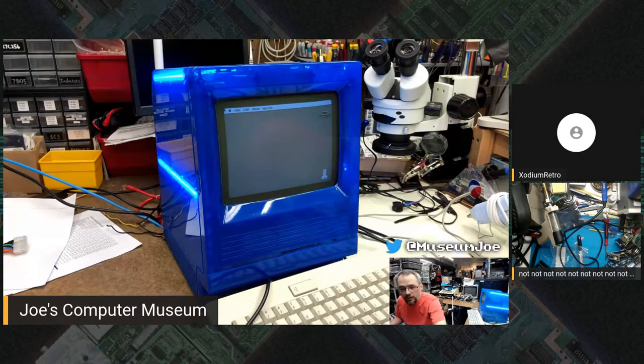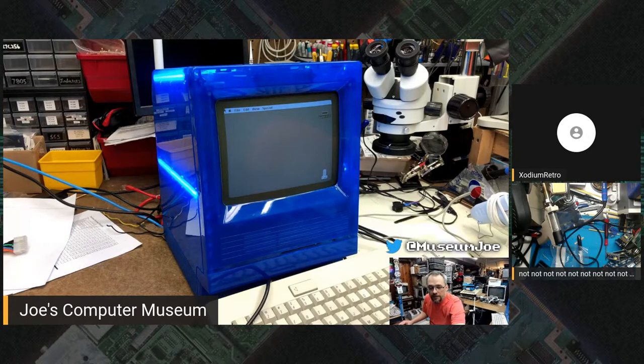I don't know how you can put it in the ASIC versions or ASIC SCSI systems. It's a little bit easier to do because you can handle it with a state machine, because it has very tight and specific timing requirements. When you're using a system that uses a program instead, it's hard to do that because you have to very carefully manage the timing with interrupts and this and that and the other and count cycles and all of this other stuff. I'll just put it that way.